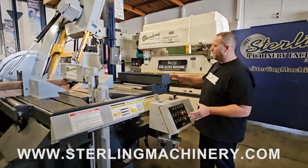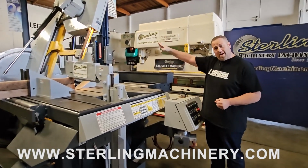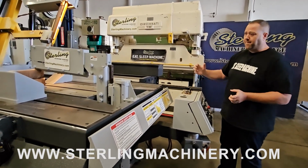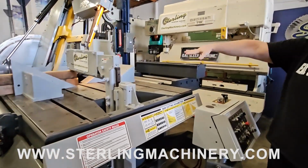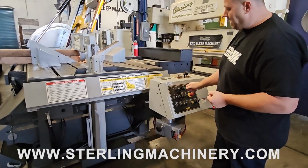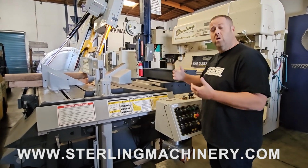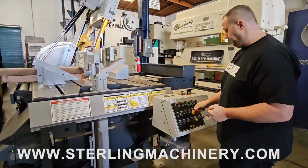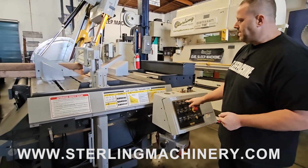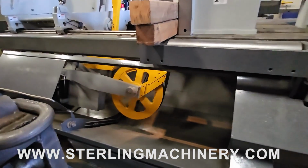All right, now that we have our blade going, we know that we have our consistent blade speed, we have our guide arm in the correct position, a little bit above your material, to allow for some nice support for that blade. We've got our vises clamped down, not only on our bundling, but our right and left vises. And now we're going to go ahead and advance the head. This entire head's going to come forward, cut into the material. Once that cuts, it'll retract with the turn of a button. Here we have our head advance. Now you'll notice our head will advance to the limit switch that we set.